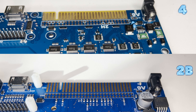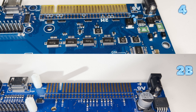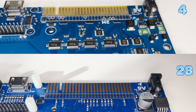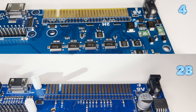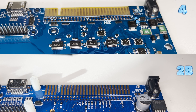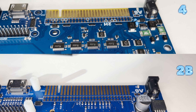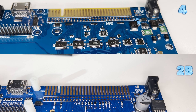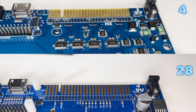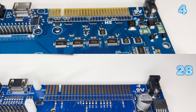Instead, these fixes would need to be applied via some kind of aftermarket add-on plugged into the expansion bus of Issue 2 machines. Bus loading issues were seen when some combinations of multiple peripherals were plugged into the Issue 2 expansion, and one way this manifests is in ghost key presses detected from the expansion bus, when external pull-ups on the data lines, further burdened by added capacitance from attached peripherals, aren't fast enough to pull higher than 2V during an IO read on port FE. This also happens on original Spectrums but is made worse on the Issue 2 due to the expansion bus being 3.3V. The move to 5V and level translation is expected to improve this.